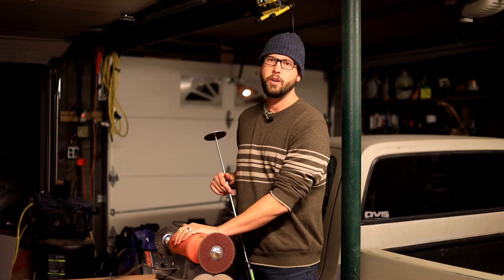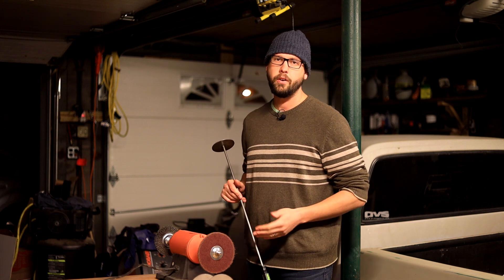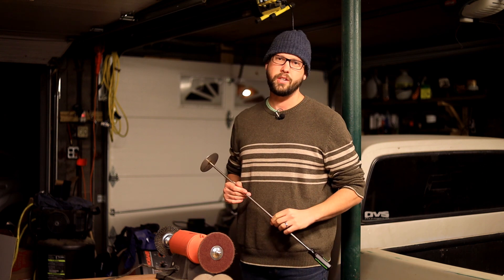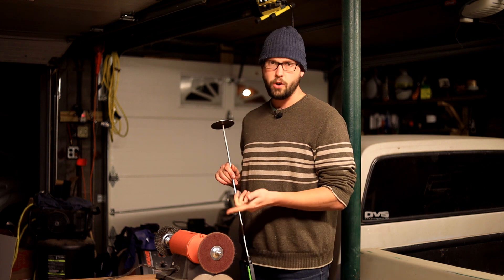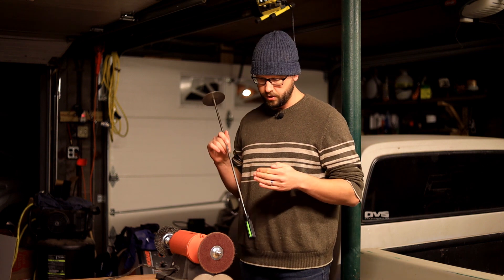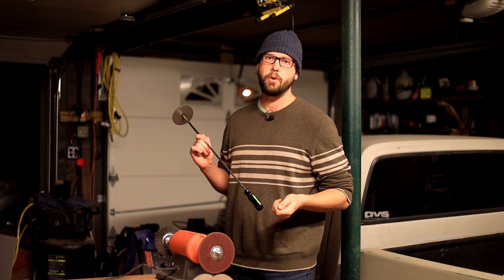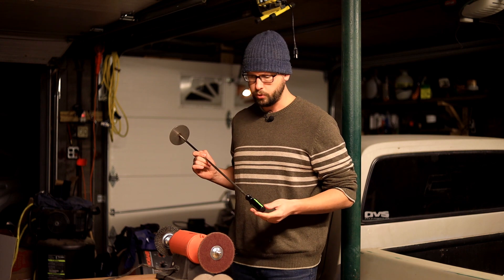Now that the acrylic paint is dry, I've come out to my buffing wheel that I've put an abrasive scuff pad on. The reason I like to use this larger diameter is it just doesn't get down into the letters as badly as when you use a really small diameter like on a Dremel tool. But it's not to say that you can't do it with a Dremel tool.